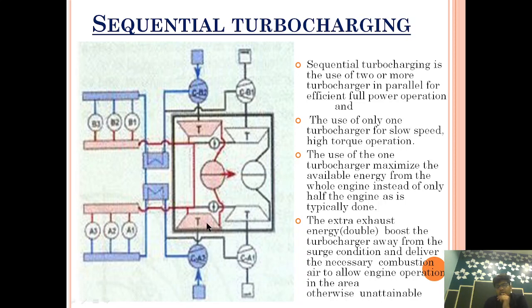For example, if the engine is running at 40% load, we are not utilizing all four turbochargers — just two of them. These two active turbochargers fulfill the air requirement for combustion. By switching off the other two, more exhaust gas becomes available to the two active turbochargers, improving their performance at low-load conditions.